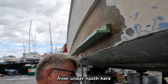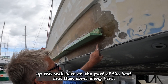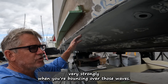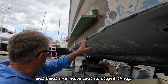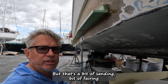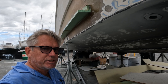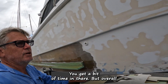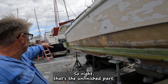I was going to glass it before putting it in but then I thought I've got to lock it in anyway. So I've got to glass up this wall here on part of the boat, then come along here on the chine and come up — it's all got to be locked into place. It's all going to be very strong because when you're bouncing over those waves you've got to make sure it's not going to flex and bend and move. There are a couple of little bits to fix up — a bit of sanding, a bit of fairing. It's underwater so I can't use micro balloons or Q-cell — just vinyl ester resin — to get that nice and smooth. Overall I don't think it's looking too bad; I've come out 100 millimeters down the back there.